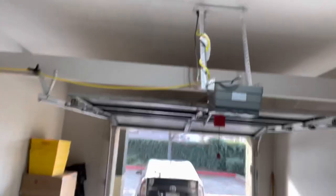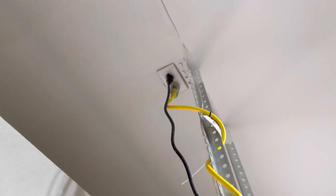At one point I thought about running it upstairs where the washing machine and dryer is, but I left that alone. Then I started thinking — was there another outlet out here in the garage? There aren't many. The only other outlet I had was the one up here for the garage door opener. This particular one is not connected to a GFI; it runs all the way to the power box at 15 amps. The Tesla draws 12 amps, and the garage door opener doesn't take much. With only those two things on the same circuit and nothing else, I can run the Tesla charger and charge the car all the time with no tripping problems at all.